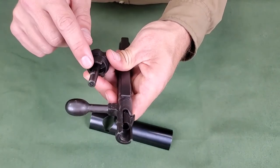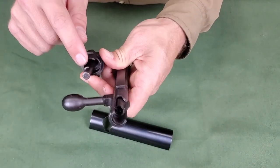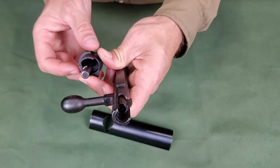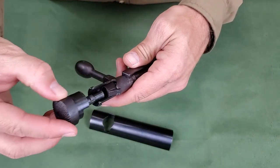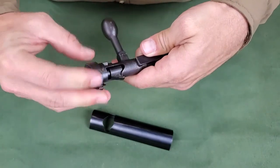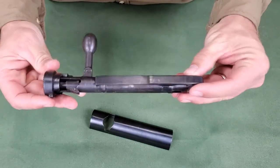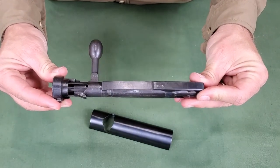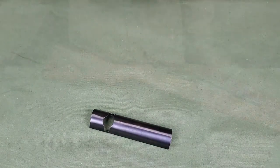In fitting the safety knob, the lug in the middle of the axle is fitted into the narrow groove on the inside of the rear part of the firing pin. Then pressure is exerted. If it does not enter, even after application of pressure, turn slightly to the left or right so that the proper contact is made. After the safety knob enters, turn it completely to the left, then relieve the pressure.